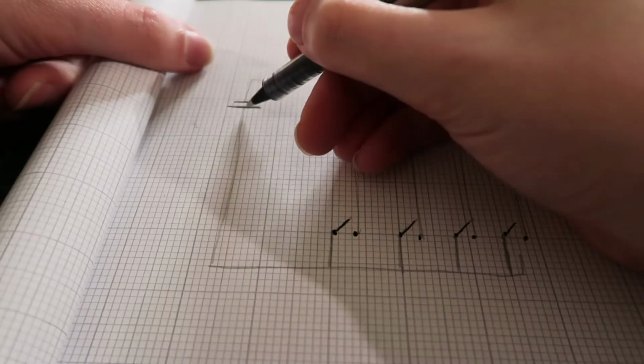In parallel, each bulb in this example is going to be on its own separate circuit. For a circuit in parallel, what you'd have is a power source, a long wire coming out, and then junctions off of that wire, where you'd have your switches and your bulbs, so that each one is essentially on its own circuit. If one of them goes out, it doesn't blow the whole thing. And the other advantage is that you don't add resistance the more bulbs you add. In fact, there's complicated maths that goes on in there, and you can end up with less resistance than any of the bulbs. But you don't worry about that. We're not concerning ourselves with that right now. And more importantly, you'd be able to switch off any of the bulbs without destroying the entire circuit, which is something you wouldn't be able to do if they were hooked up in series. So to go.